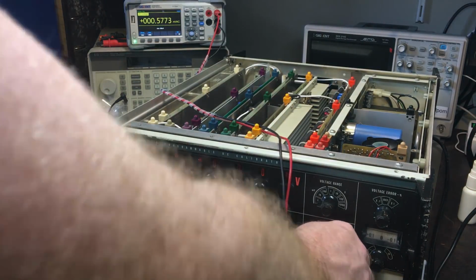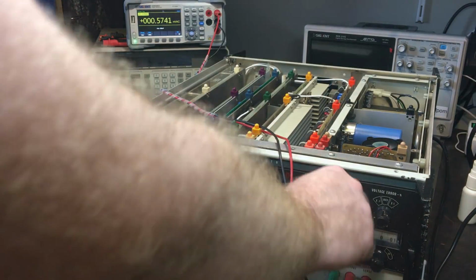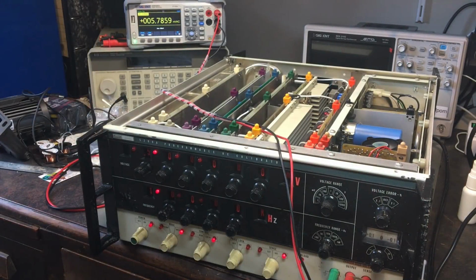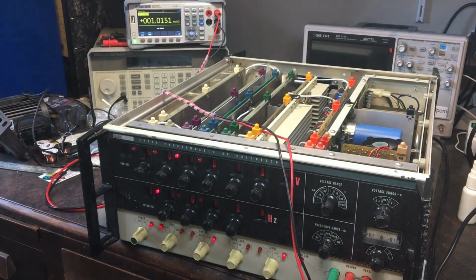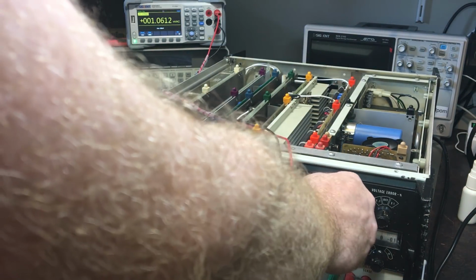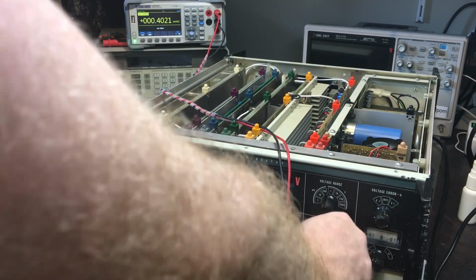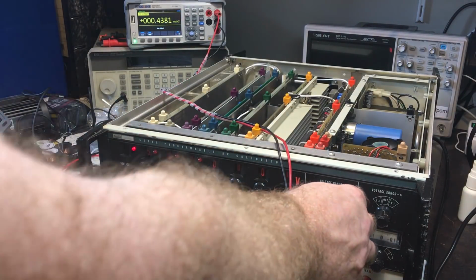That's at 100 hertz. So if I go to 1 kilohertz, we'll see if that changes anything here. So 1 kilohertz range, it might stabilise the readings a little bit, with a bit of luck. So it's 5 millivolts, 50 millivolts, and it's not. That's right, there's a dodgy switch connection here, isn't there? One of these is a bit dodgy. That's right, should be doing half millivolts, sorry.